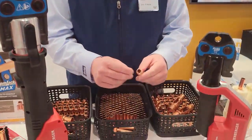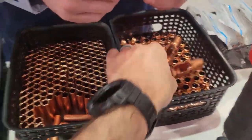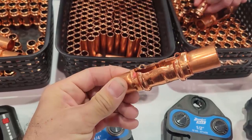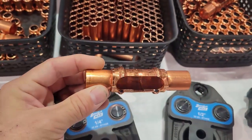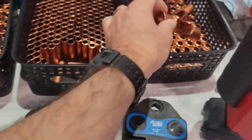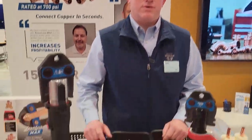Yeah — there's an O-ring on the inside of the fitting. So if you have a sharp burr on the outside, there's a chance to put a little nick or rub. There you go on the cross section, so you can see that. As you insert the tube, if that's not a smooth edge — you actually want to make almost a chamfer on that outside edge. It helps with installation, makes it go in a little bit easier, and makes sure you don't damage that O-ring when you install it.